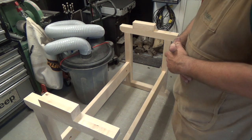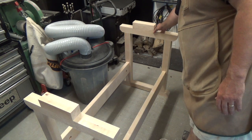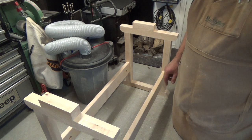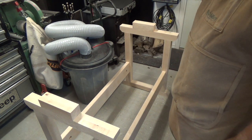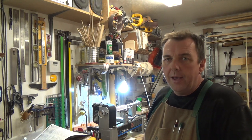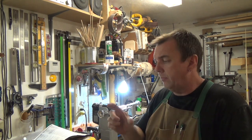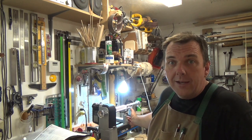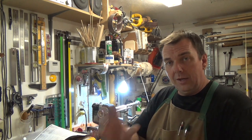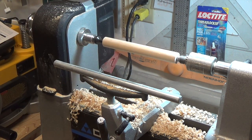I've shifted over to the other side of the shop since I ran out of room. We've got our filler blocks in place, lined up with the lines we put there earlier with the square. Now we glue them, clamp them, and wait for that to dry. For the next step we're going to need some one-inch diameter dowels, two of them, two inches long. I don't have any, so we're heading to the lathe to spin some one-inch dowels.